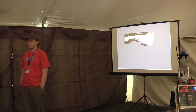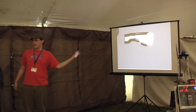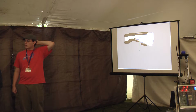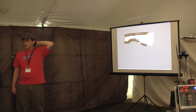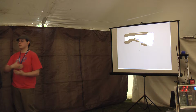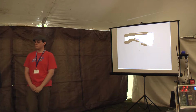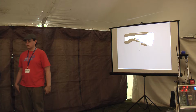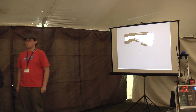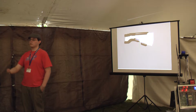What do you do then? Then that cell becomes occupied and that becomes searched. So then you make a movement based on the fact that there's something there. It changes the search path, and that will change where the robot is trying to travel to. So we built up a map where we know where things are or aren't. So if we get to a point where we are stuck, it will know that it can turn back. It's constantly replanning.